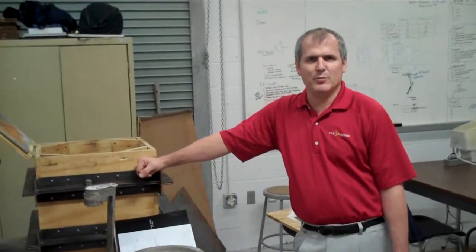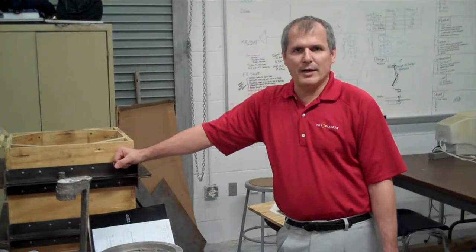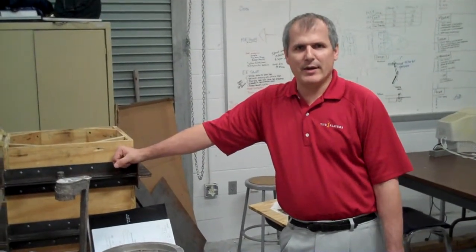And today I'm going to talk to you about a dyno. A dyno is a device that's used to put an artificial load on an engine so that you can measure the torque and from that calculate the horsepower on the engine from a static position without actually having to put it on a track.